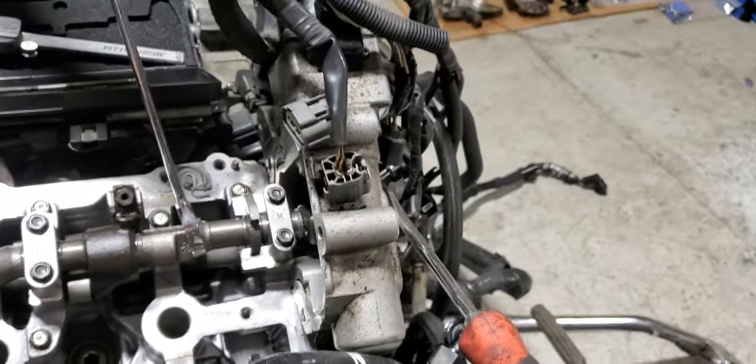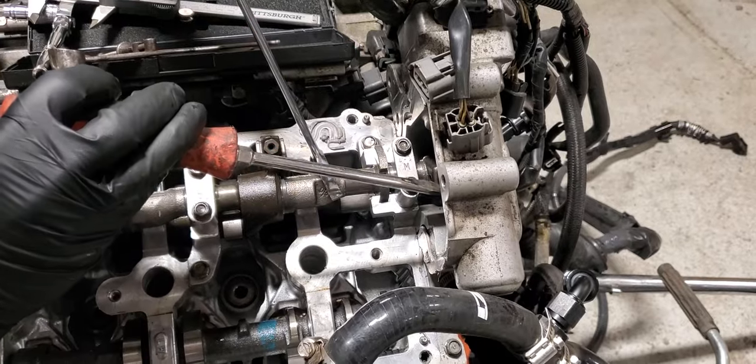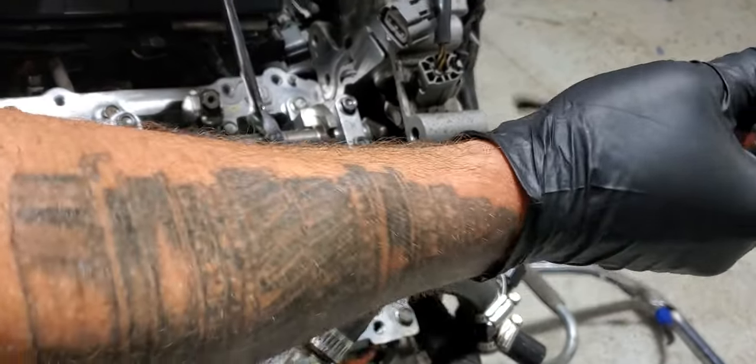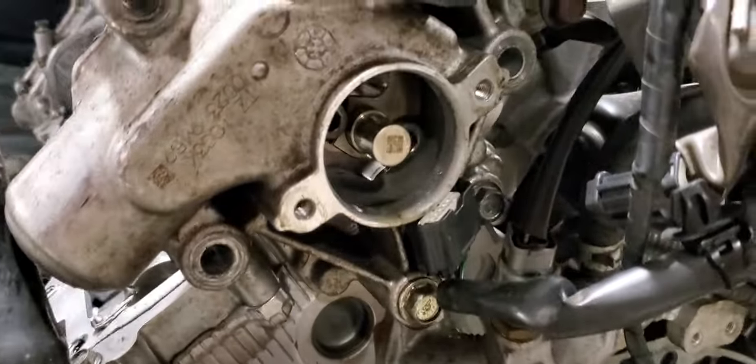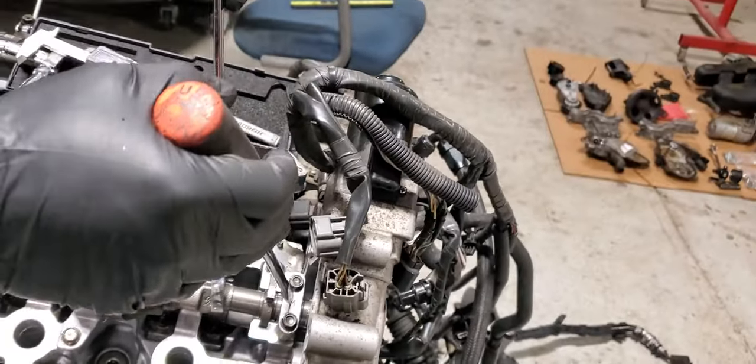When you go to the back 6mm Allen heads, this thing has to be set locked with the 1.585 inch dimension, then lock down your 6mm. Now you've made the 5.5 degree inclination from the factory that it has, where the control cam is degreed.